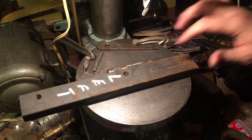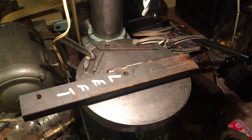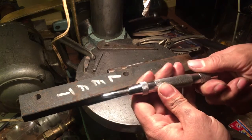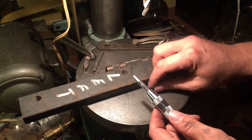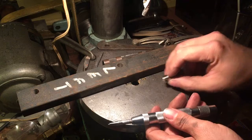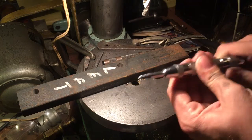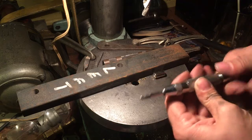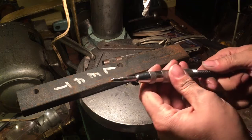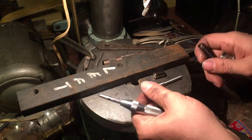I had this cheapy one and it does hit significantly harder now — though the camera isn't really picking it up. One of the reasons for that is I actually took it apart and replaced the hammer in it. The idea was that if I could get a hammer with a little bit more mass, it would hit a little bit harder — and it worked.